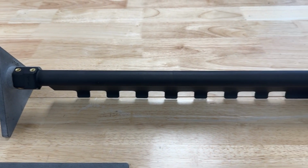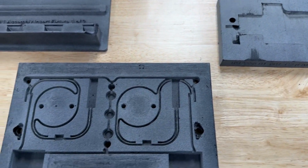What we see a lot of use cases for is maybe a metal replacement. A lot of what we're seeing is not only part manufacturing, but just production. Soft jaws, end of arm tooling, and a lot of automation equipment has a lot of custom work holdings, right? And this is a great way to have a customized work holding that you can engineer or design to hold a specific need. It's not just off the shelf, but it's also non-marring, which is important because a lot of times you have tooling out of metal and you can scratch your product. So this is a great option if you have work holdings. And then just brackets and anything that you need a lightweight, high strength material. Markforged is one of the best options that we have available.